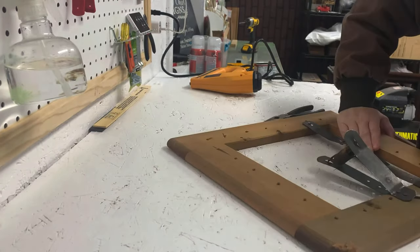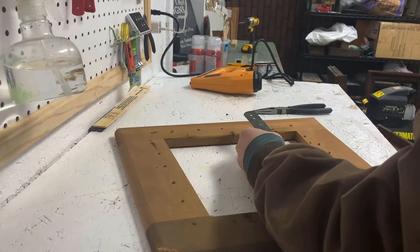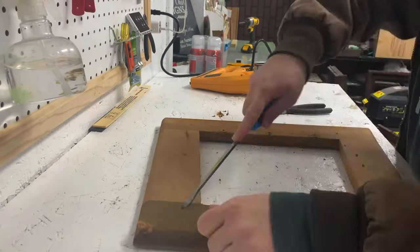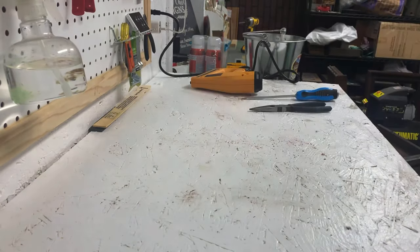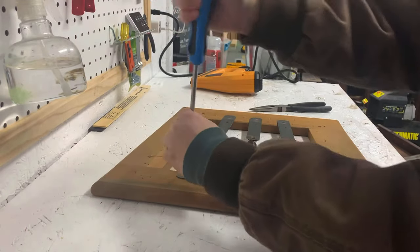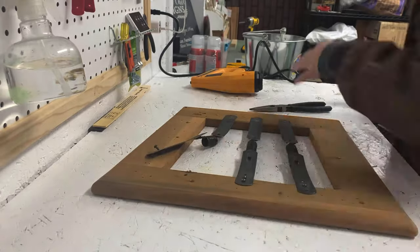And then after I get all the springs out, I take those little tack nails off where the burlap was. So you need to be careful on the springs. If they still have full tension in them and you go to release it, it will snap back or pop back and you have a screw or something flying. You wanna make sure you wear eye gear for this part.